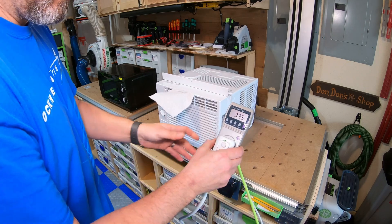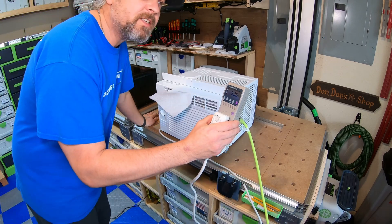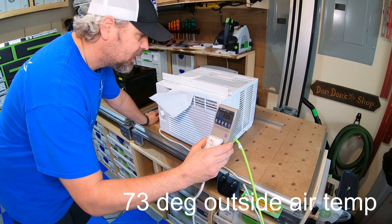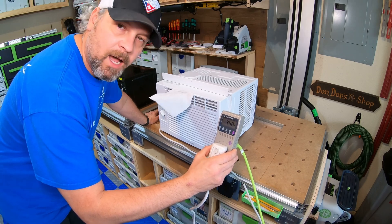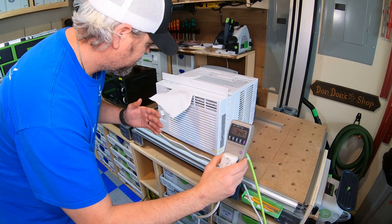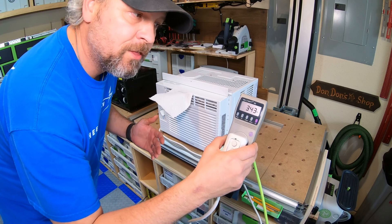It's kind of hovering around 330 volt-amps right now. Let's go to high cool. Right now this thing's only pulling 335 watts — it'll gradually increase, but so far this little tiny Sportsman generator will definitely run a 5000 BTU. This is a Frigidaire mechanical control, nothing fancy about it. I'll put the link in the description, but that's putting out some cold air. Right now it's still only pulling 343 watts.